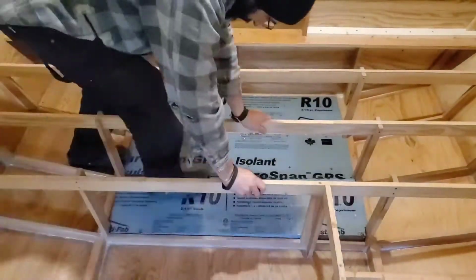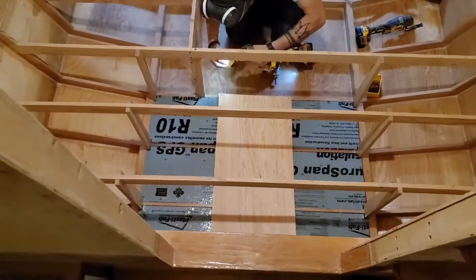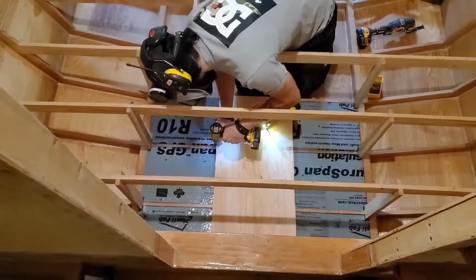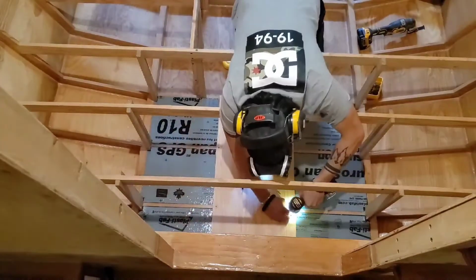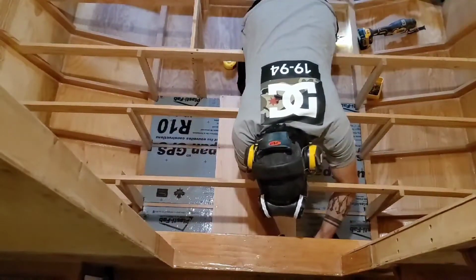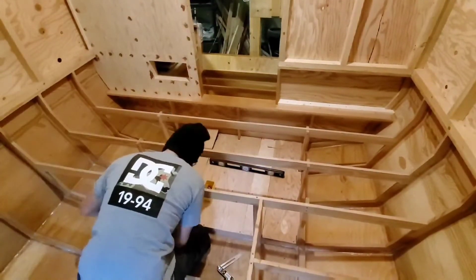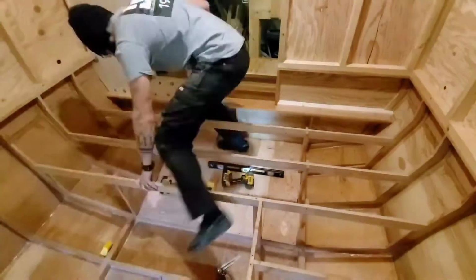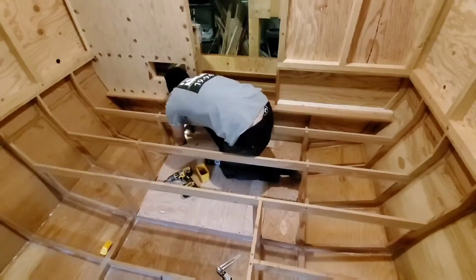And since I don't want the tanks or the pump to sit right on the foam, I try to cover this whole section with 1/4" plywood. Now, because all of this will be super hard to access later, I purposely try to puzzle in smaller pieces so I could get them out again if I need to. Out of all the places, this is probably the one that, with some bad luck, has the most potential to see some form of water damage, so it's nice to be able to work on it if I have to. By the way, the entire inside of the hull of the boat is sealed with epoxy and polyurethane, so it really would be just this layer of plywood that would take any damage, if at all.